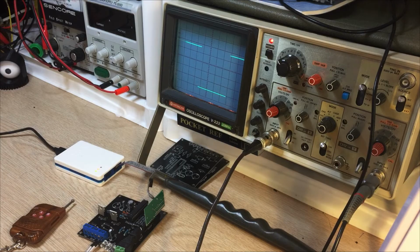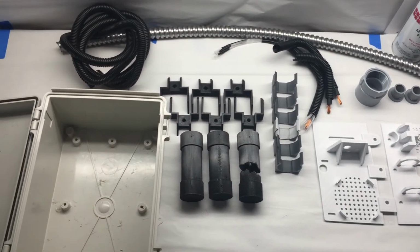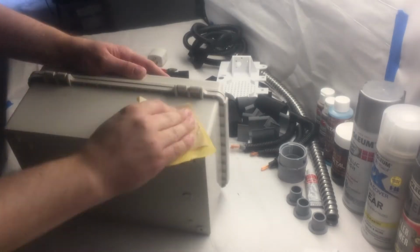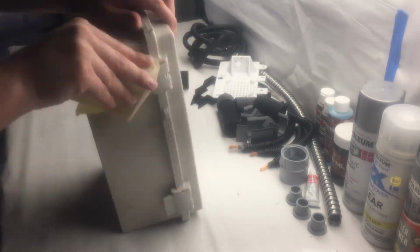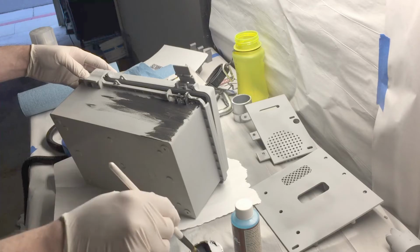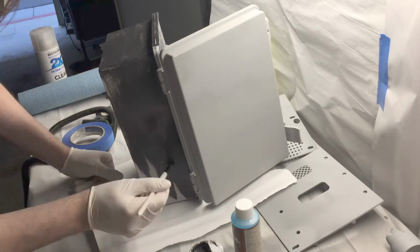The prop started its life as a gray ABS case and white PLA prints, but of course I wanted this prop to look super grungy. So the entire case was roughed up and painted with a paint that actually contains iron particles in it. An oxidizer applied throughout the case causes the iron particles to actually rust, convincingly producing the illusion of a well-worn metal fuse box.